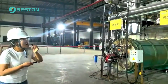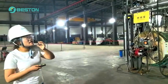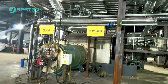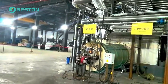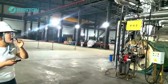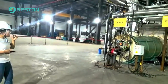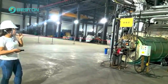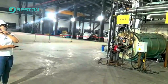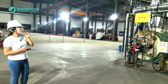Okay. Just now, we learned that the syngas goes back to the heating system. Here, this is a syngas tube. This is a flame arrester. This is a safety device. The syngas goes through the syngas pipes back to the heating reactor system. We use automatic ignition for the syngas burner. This is very convenient for the system.